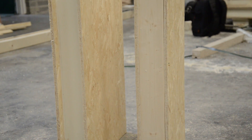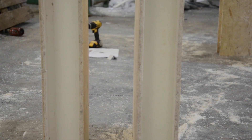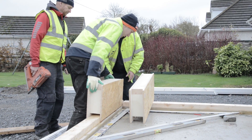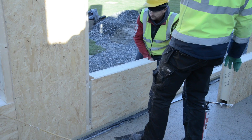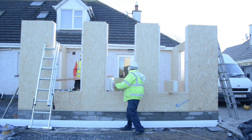The tech panels are at the heart of this build — so what are they? Tech panels, manufactured by Kingspan, are structurally insulated panels, or SIPs for short. A SIPs panel is a structurally insulated timber panel — two layers of timber with insulation between them. With the SIPs panel, it's the speed and ease of construction, the cleanliness and tightness of construction. It offers huge adaptability, huge ease of construction, and a huge speed of construction. It's a well-suited, well-adaptable material. The manufacturing process is well tested, well tried, and the quality control in the manufacturing process is very good.